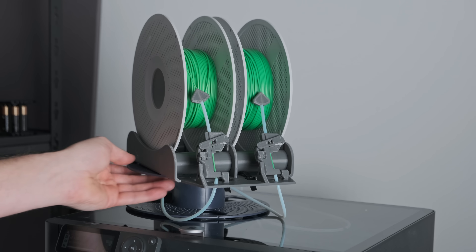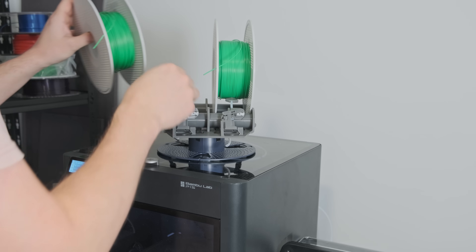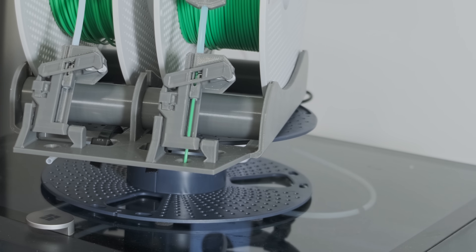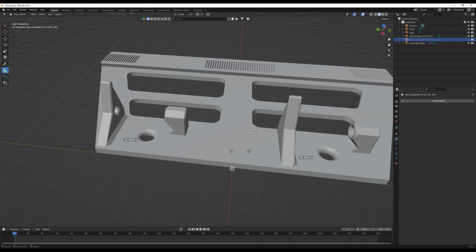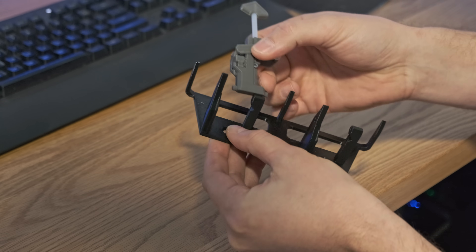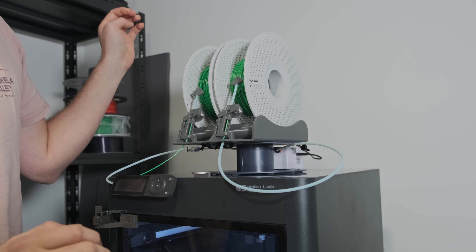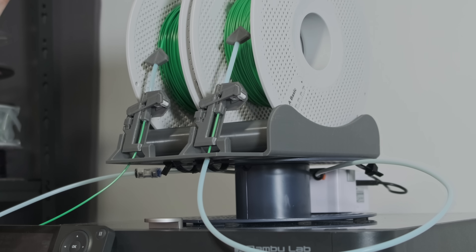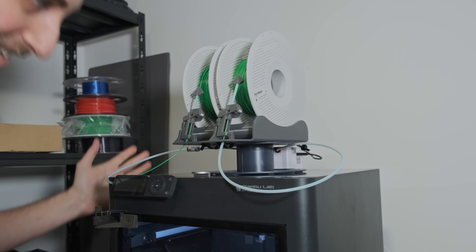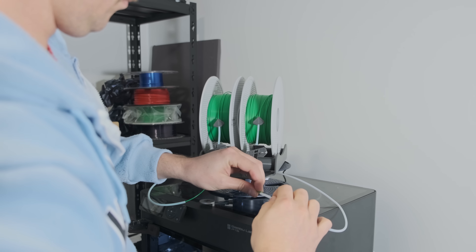I personally thought this prototype looked pretty cool, but I ran into my first problem straight away — I couldn't feed the filament through because the angle was far too sharp. Great start. So I went back to Blender to see if I could raise the mounting bracket, but then I realized the bracket would become too flexible and the cutter would most likely pop out. Then I realized that if I just increased the length of the Bowden tubes, problem solved! I could have done this in the beginning, but I didn't. So now with the feeding issue fixed, it was time to figure out if the auto refill system even worked.